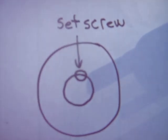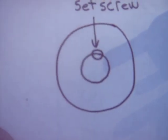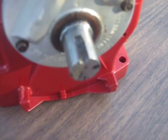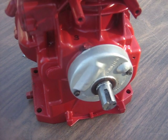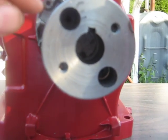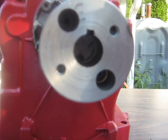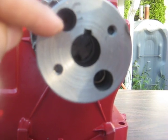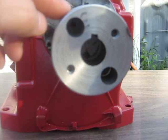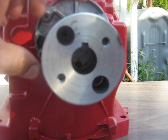To drive it, we put a set screw machined halfway between the shaft and the collar. You can see it in the end of this one here — threads in there. Had to do that on a mill. We have countersunk head bolts, two of them. These bolts in here attach to the far collar through the UHMW, and then there's two similar ones coming here and here. So the plastic is the only thing that drives it in between — there's no mechanical connection between the two shafts, although the plastic is not near as soft as rubber.